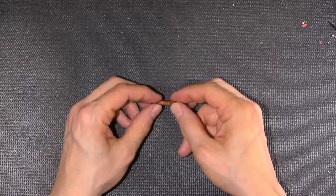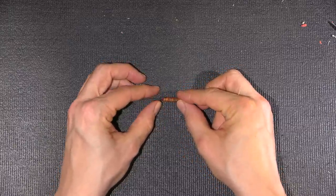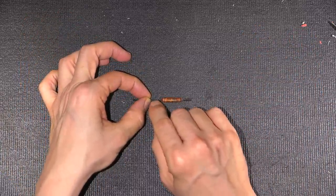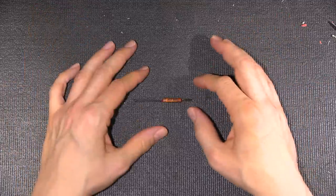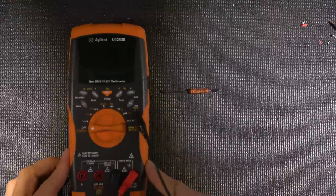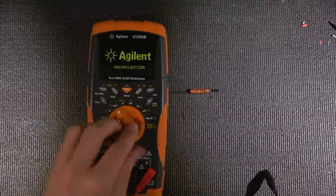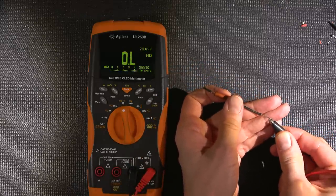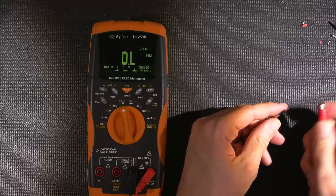So now, a lot of people think that they can test these capacitors just with an ohmmeter. So again, I explained about parallel resistance being leakage, so you can picture a resistor across this. Well, if there's a resistor across it, can we not see that with just a standard DMM? So this DMM that I have right here measures up to 500 megohms. I'll just turn out the light here so we do not have a glare on the screen. I'll turn this on. Okay, and I'll attach this up to this capacitor here, and we'll see what we get.